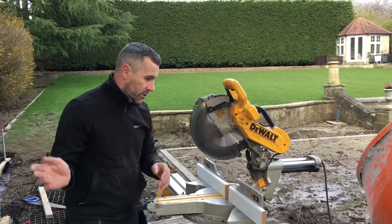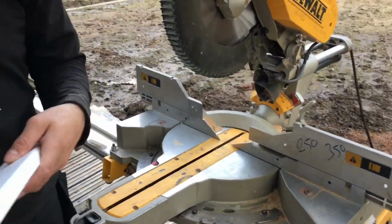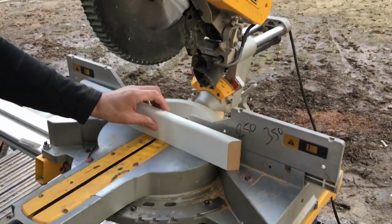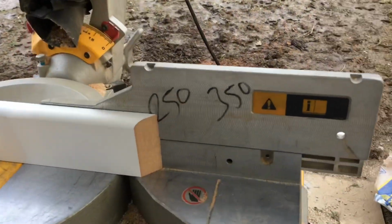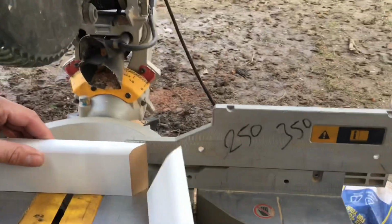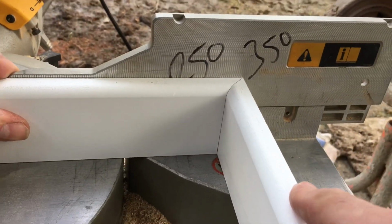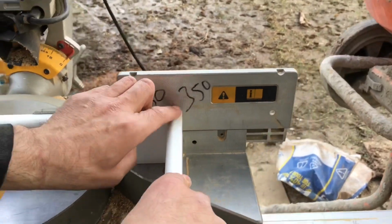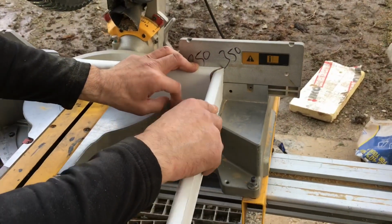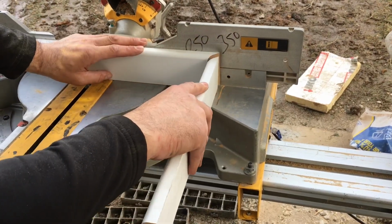So we're doing skirting board, so I'll give you a little demonstration how to do a skirting board in case you don't know. Lots do, but in case you don't. So, internal mitre, generally it's 45 on internal, but it might be more, might be less. There's two ways of doing this. Traditional way is to scribe it, which I'll show you in a minute, or the other way, which isn't the right way, is to actually cut your mitres, butt it up like that, don't know if you can see it, and there. And that's if you've got a perfect right angle, but often corners are, there'll be a bit of plaster on it, a bit of crap like that, and you'll be left with gaps. And if it's softwood, it'll tend to shrink back.